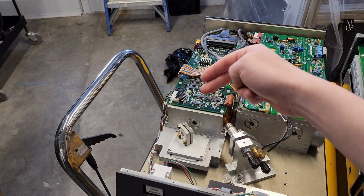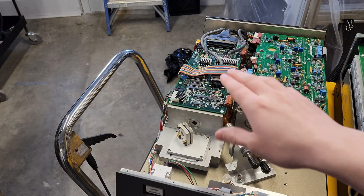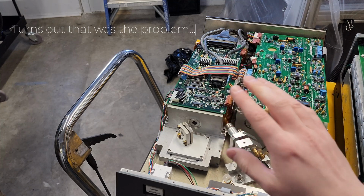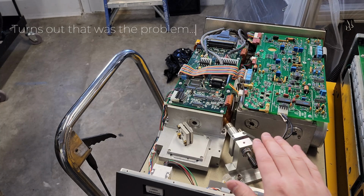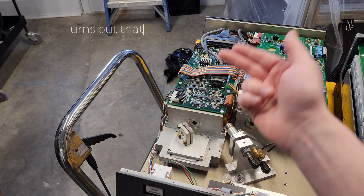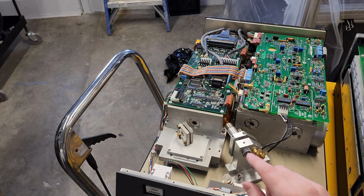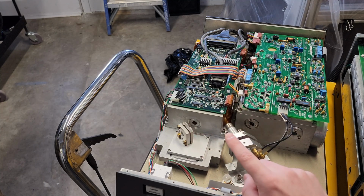If our green laser doesn't produce light, well, we know we have a problem. Then we have to open this up and see where that issue is occurring inside this laser. If this produces green light, we may not have such a big problem, but it might still not be great. The next thing I can do is put a mirror in here and catch this beam and bounce it out, measure its power, see if it's what it's supposed to be, see if it's stable, and then measure what the beam profile looks like so we can see what the mode coming out of this laser looks like.